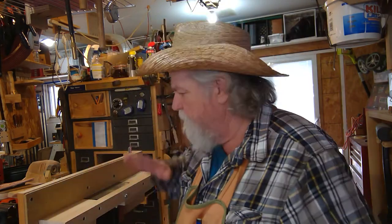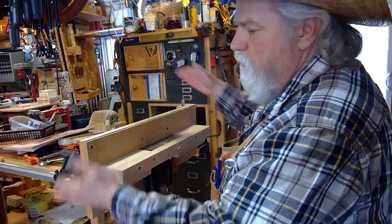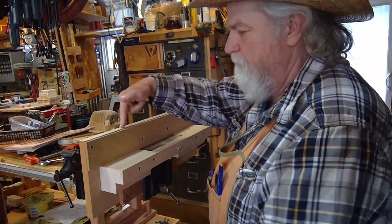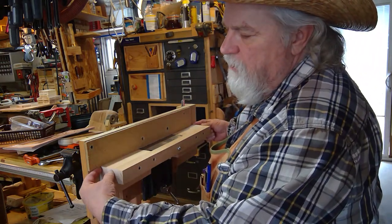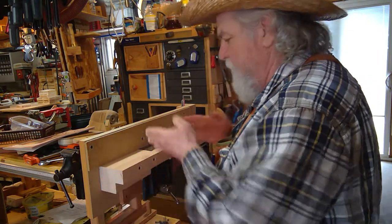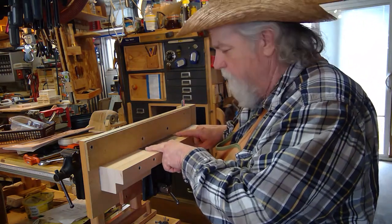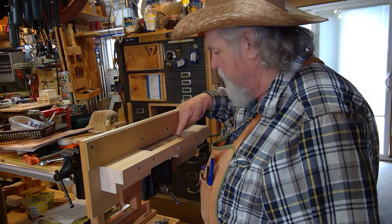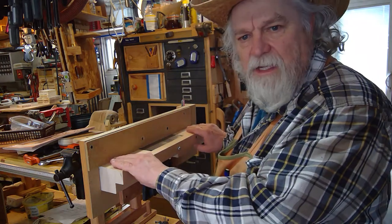The article shows you how to take a block plane and turn it into a full jointer table. I built it this morning. The two major pieces are a 22-by-8-inch piece of three-quarter-inch plywood, and a block of wood that's two inches by two and a half inches. I screwed the block to the plywood, cut it in half, and made it wide enough to set my block plane in.